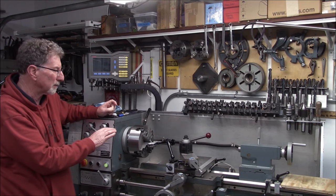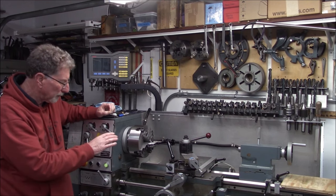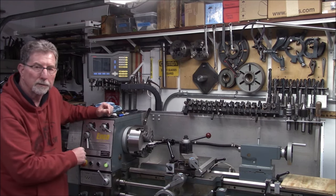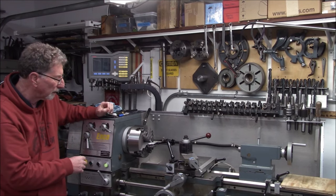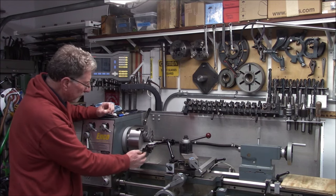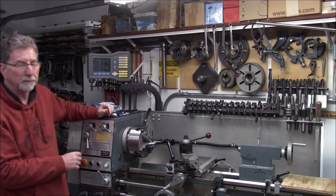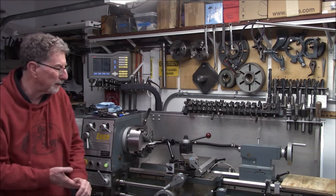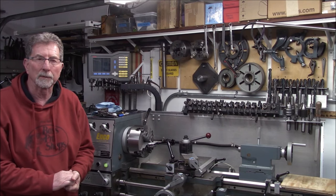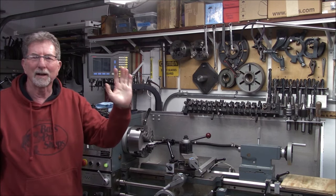The taper accuracy is pretty good, but since we redid the leveling of the machine I'm going to dust it off a little bit, test fit it again, and if all that looks good we're going to re-grind the chuck jaws — leaving them in the same orientation they are right now. We'll re-grind them internally and probably have to re-grind the external steps as well. It'll be a lot of work, but we're this far down the road, why not finish it off and do it right. That's the plan — it's probably going to be about two weeks before we get to that, so just hang tight and we'll get a video out. Thanks a lot, we'll see you soon.